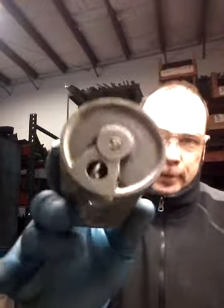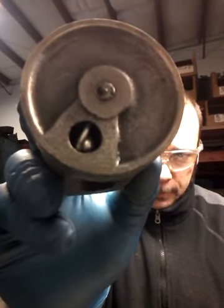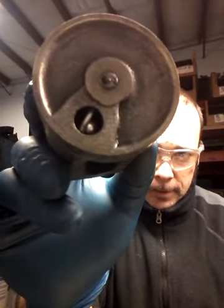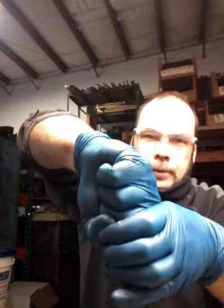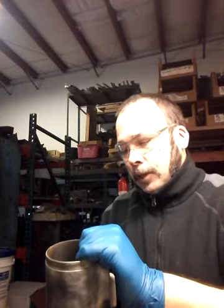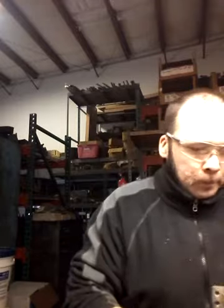And see that little ball bearing in the fitting where it's kind of loose, and a pin that holds it in place. The ball bearing can rattle around when it's letting fluid in and then get like a stopper, get plugged up, and then force the fluid through the valves. But anyway, this will go in here and work it. Make sure you hear some kind of compression.